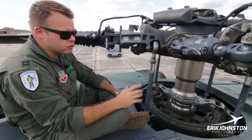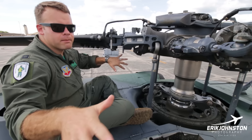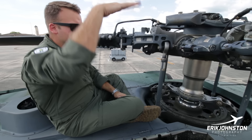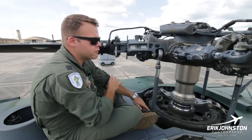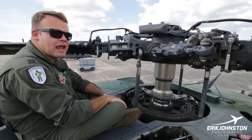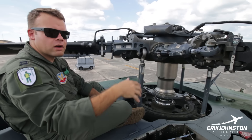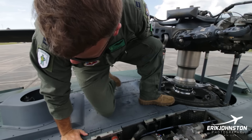This is the main swash plate. For any helicopter, when you want to increase altitude you use the collective — all the blades take a bigger bite out of the air collectively. With the cyclic, if you want to move forward, as the blades spin in the rotor disc you want that disc to tilt forward, so you push forward on the cyclic and flight control surfaces up here move to allow those blades to take different bites out of the air. If you want to move right, you slide it right and the blades all adjust so the rotor disc tilts right.